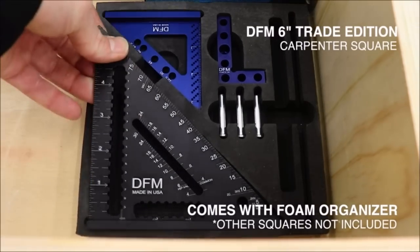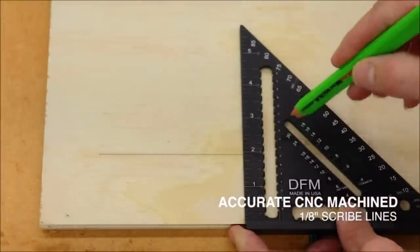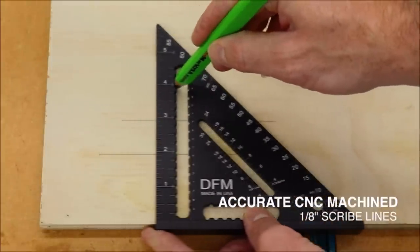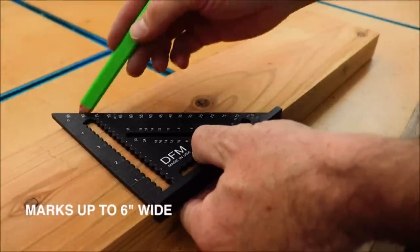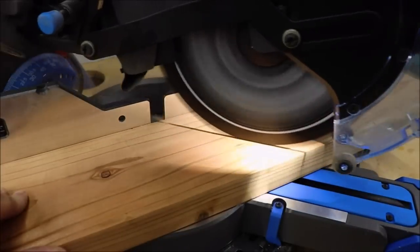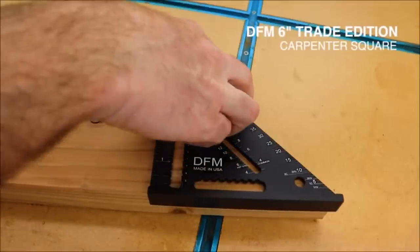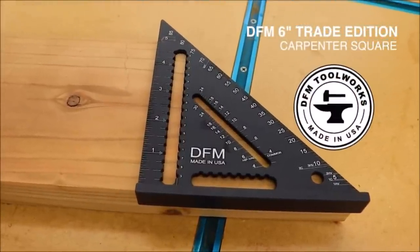The square features 1/16-inch increments laser etched up to 5 7⁄8 inches, and can be scribed with a carpenter pencil or marker in the 1⁄8-inch wide notches all the way. There is a hip rafter and common rafter conversion table to degrees, for use with an electronic level or angle gauge. The foot is a quarter inch thick and can be used to gauge heights and squareness of your table saw or router by adding a quarter inch to the measurement read. The square is large enough to mark cross cuts on a standard 2 by 6 lumber.